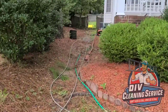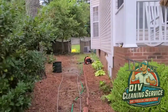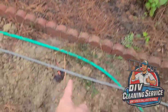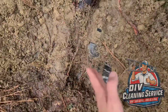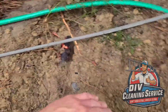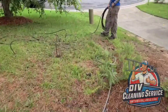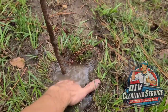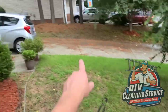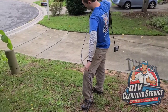This side of the house — I didn't film it because it was nasty. We had the very last drain outlet over here; it comes straight and then this drain right here tees off right here. You can see there's a tee, and also the roots have grown on it, so there's a big dip uphill, a big dip downhill, a big dip this way, which makes it very difficult to get the jetter around. But we did get that done, and then it simply ends right here in the middle of the yard. I can feel the edge of the drain right here, so we're going to recommend to the client that he puts a pop-up emitter right here and right over there on that side.